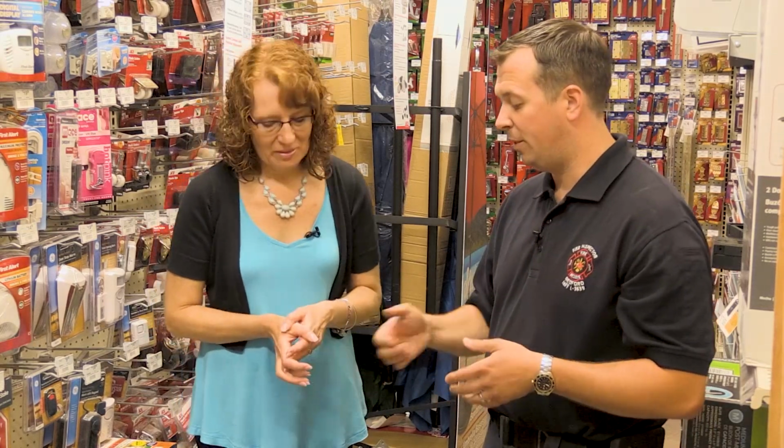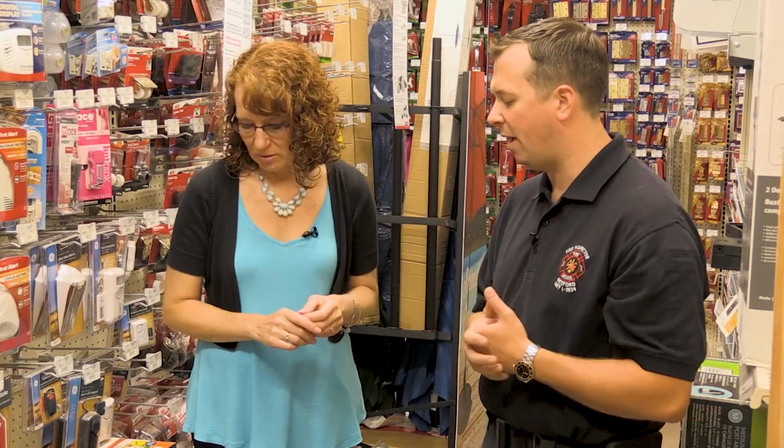Yeah, absolutely. Great. And how long should we replace them? Yes, they're good for about 5 to 10 years, but that's again only if we do that little preventative maintenance we talked about earlier, flipping them upside down and tapping them. Right, good reminder. Because they all have that dry chemical powder in them, and they will get solid and it won't be able to come out.